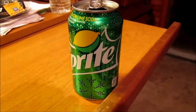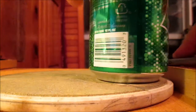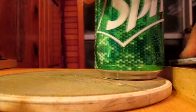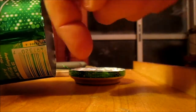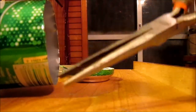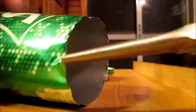Slice the bottom and top of the can off. But this piece has to go inside the next can that's here. So we need to make this slightly smaller to go inside the can. And the way to do that is you take a little needle nose pliers, just about an eighth of an inch, a quarter of an inch is all you need to grab a hold of it. And you give a little tweak and you go around and kind of crimp the edges.